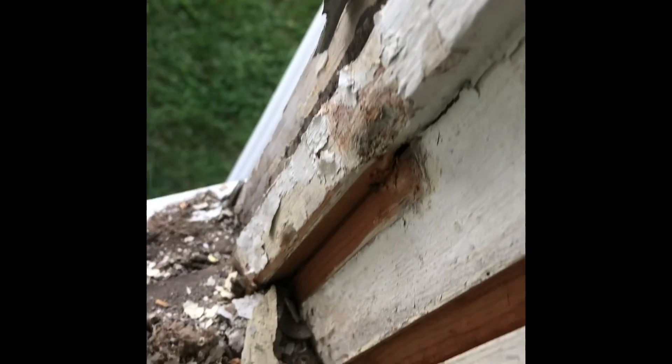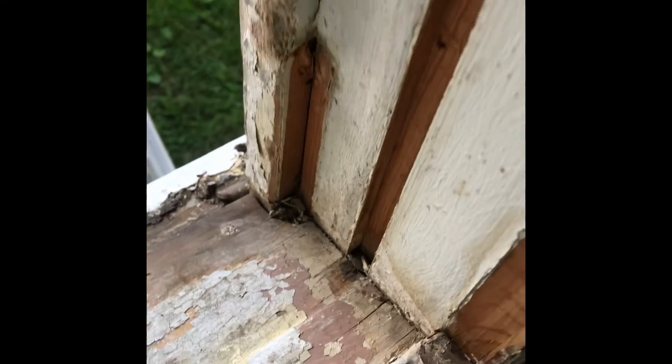We're going to have a nice clean working area to install the new window. Once this is all cleaned up, we're going to put the window in first and get a rough measurement on it. We also want to clear away any old caulking. I'll do that now. I've dusted and brushed away most of the big debris — now I'm going to use a scraper and clean up any old peeling paint. You want to do the job right. I'm also going to score this edge better; this is all old molding but I don't want it to peel all the way down. This is all painted on the outside — we just want it to look as clean as possible, so I'm going to cut that old caulking off.